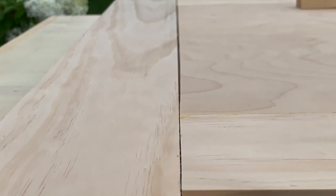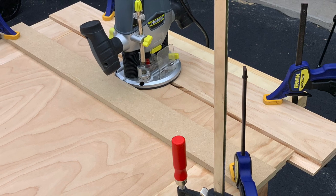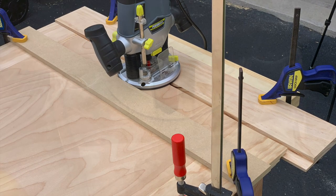And here's where I realized why using the jigsaw was a slightly less than optimal solution. While I had used a straight edge to keep the saw on track, the blade itself has more flexibility than I had realized. So my actual cut wandered slightly, causing a gap in the joint of the breadboard ends. To solve this, I threw a Hail Mary to my router and tried a technique I had seen used to joint two pieces nicely together.